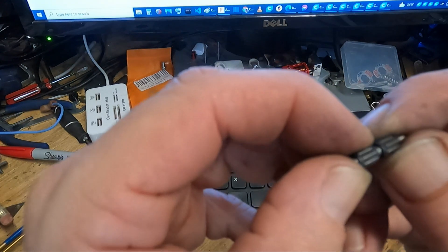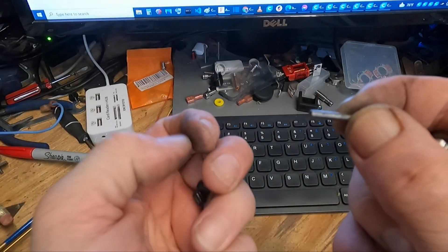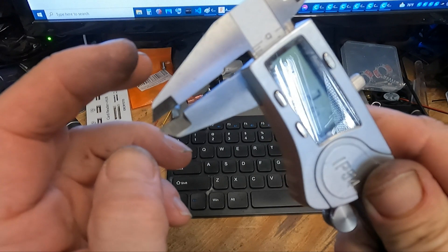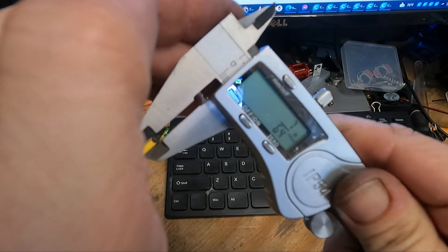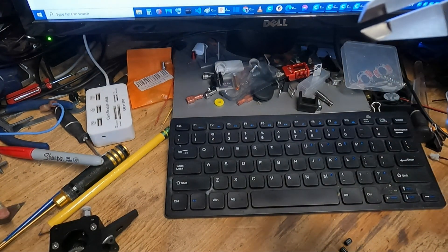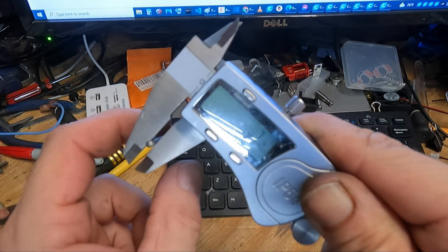Here's what we're going to do. The bearings don't look bad, probably because they're stainless and the soft — whatever this shaft material is — is garbage. When we measure in millimeters it's 2.87, which is no help. But in standard, that's 7/64ths, and I happen to have a 7/64ths drill bit right here.